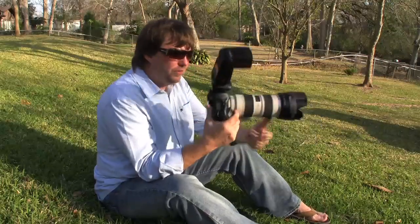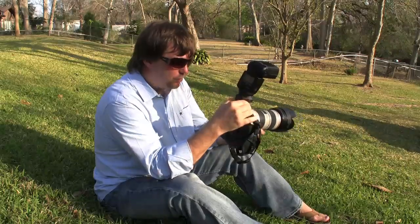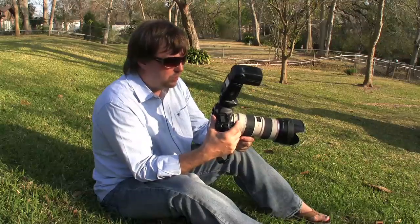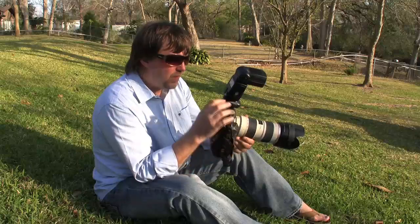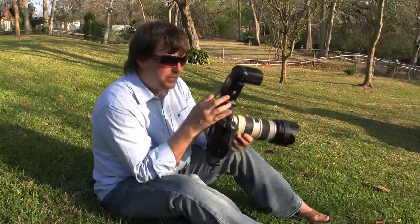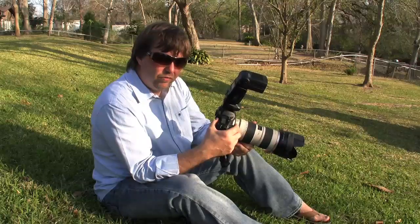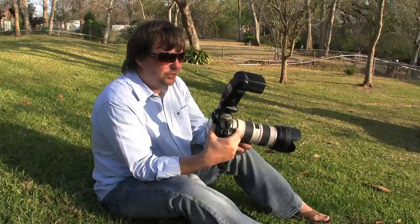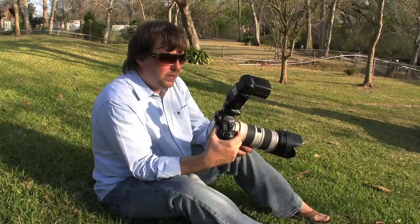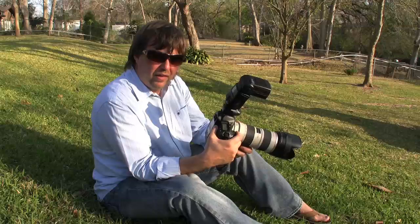The system on the Pocket Wizard — this is our flash. If you want the flash functions, you have to mount it onto the TT1 or TT5 transceiver. This is just the mini TT1, which is only a transmitter. While the hot shoe is really, really nice — no question, it's easy, quick, and fast — the pass-through system where the mini takes the information from the camera and passes it through to the flash is an ingenious concept. But you can't use everything that your flash is capable of doing, and that bothers me. As flash enthusiasts, it bothers me that I can't use it in manual mode, and that a lot of the custom functions won't perform correctly.